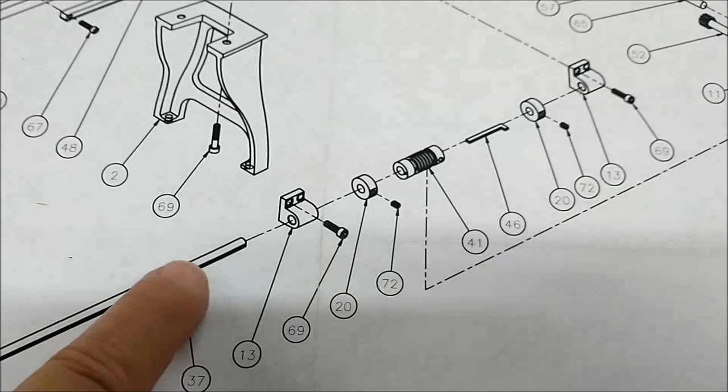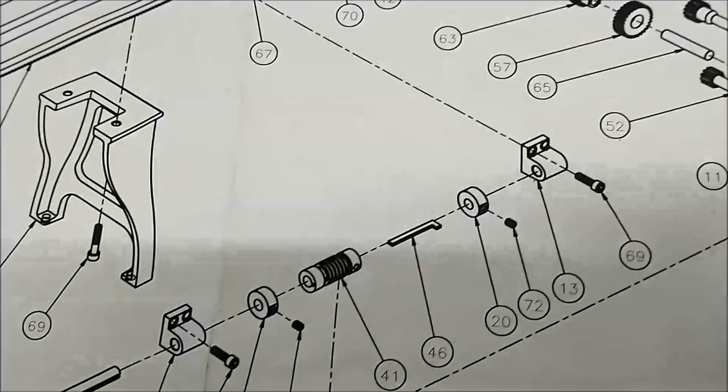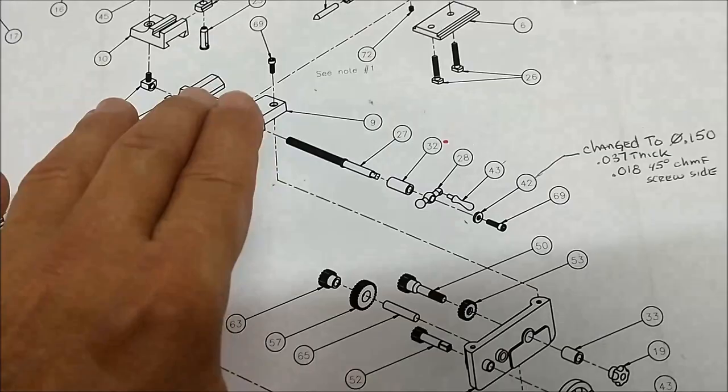But the feature on the outside, the gear mesh on the outside, is a 40 degree tooth, like a 40 degree thread instead of a 60 degree thread, to a very specific depth, so it engages all this happiness here and makes the carriage move along the bed when it spins.